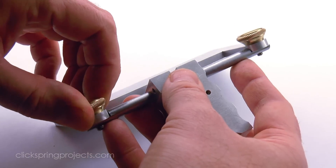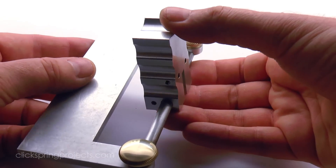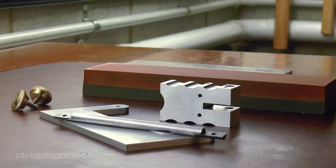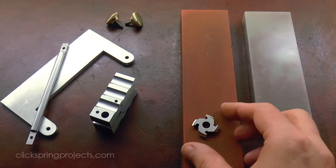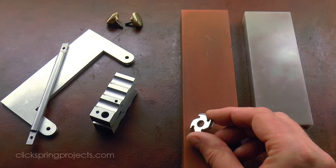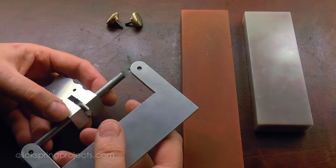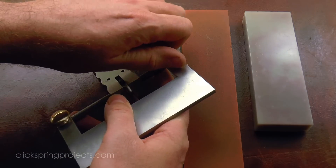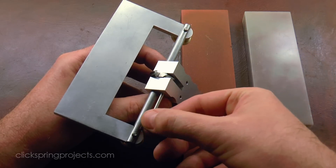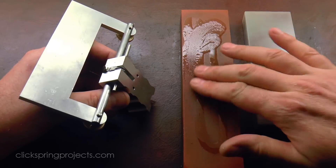Ok so now that it's all assembled, there are some aspects of the design that are worth noting. Firstly, you can see how the guide shaft keeps the cutter in a straight line as it's being sharpened. It also stops the cutter from rolling laterally, which is one of the main problems associated with freehand sharpening. Secondly, when it's placed upon the sharpening stone, the locating plate forms a plane of reference that passes through the central axis of the cutter. The cutters for which the tool is designed are 4-tooth zero-rake cutters, and they're mounted onto the shaft so that a single tooth projects from the carrier body end. They're a close fit in the carrier slot, but they can rotate freely on the guide shaft. A pin passes through a hole in the side of the carrier that also matches carefully placed holes in the cutters. This pin serves to lock the orientation of the cutters relative to the carrier, and it also permits easy indexing from one tooth to the next, resulting in a very reliable and repeatable platform to present the cutter to the sharpening stone.